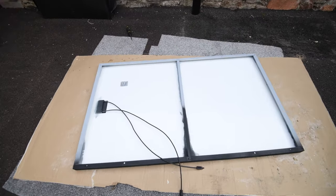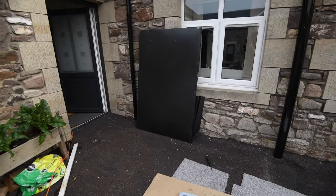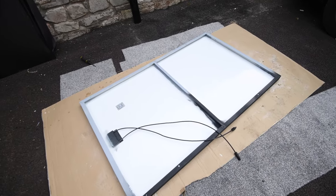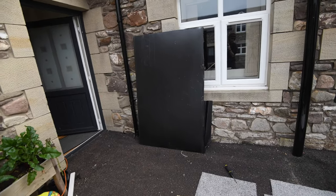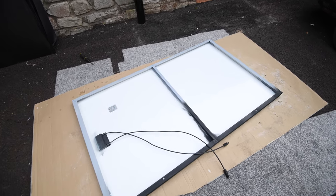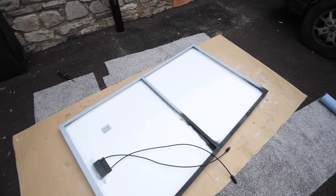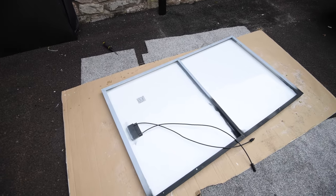If you look at a lot of safari racks online and most commercial racks for builders' vans, they come out about that far for storing ladders and so on. But because it's a solar panel, I don't really want it exposed massively to wind and potential stone chips. So I bought a bit of two millimetre aluminium plate to attach to the bottom of the panel as a guard, and also to hide the whiteness of the panel. I'm going to need to cut some chunks out of this because I can't block off the entirety of the underside — airflow is quite important to panels.